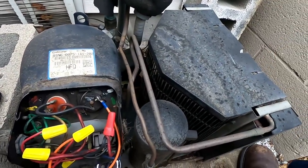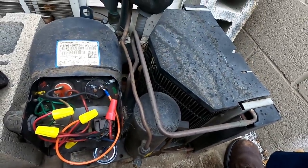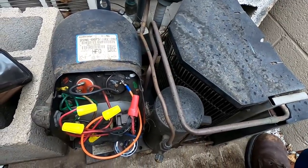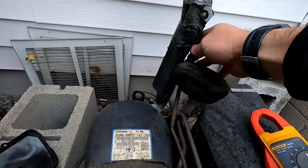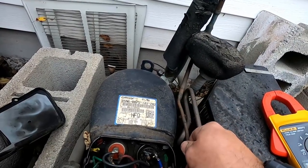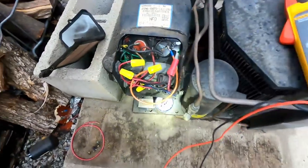She said go ahead and put the fan cycle switch on there, so we go ahead and get one of those on. Yeah, we got a spot right here, we can get it. I'd really like to see a better box on this thing. It's kind of a mangled mess, what they got. So it appears, with that being mineral oil, it's probably an R22 system is what I'm gonna guess. Might be able to read it down here on the bottom.